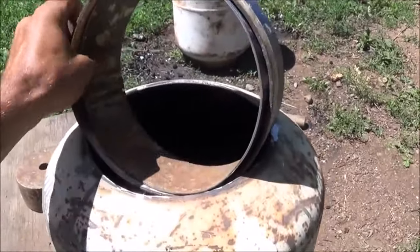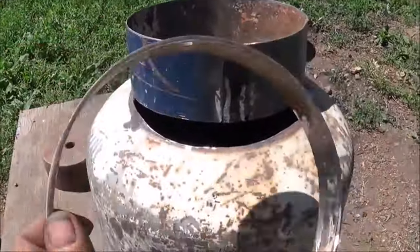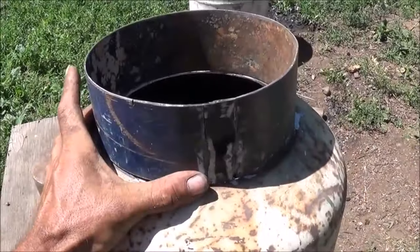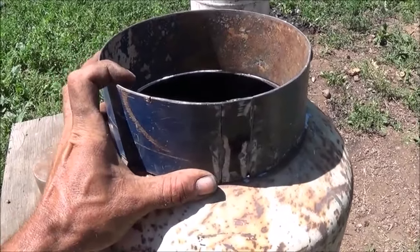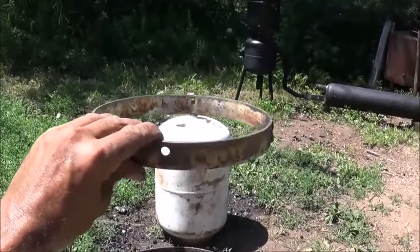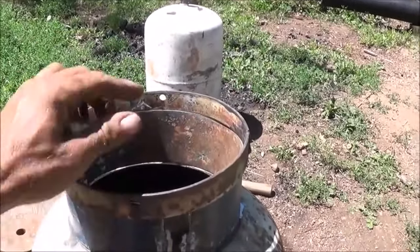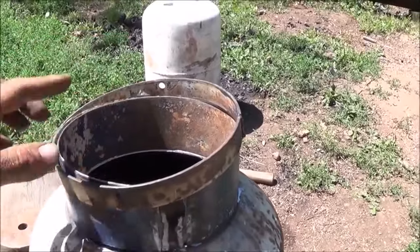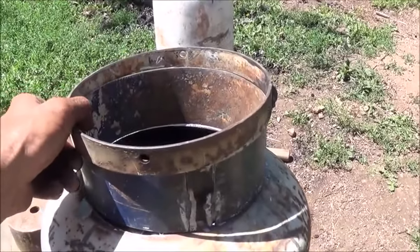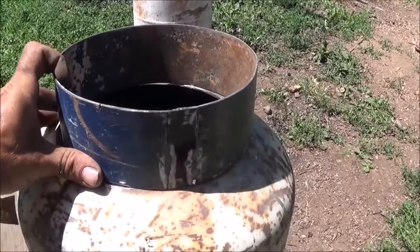On this side, I used a piece of flat stock steel and rolled it in a circle until I got the right diameter to fit inside the old ring that sat at the bottom of your propane tank. We're going to weld this to there so that ring — our reduction zone — welds right onto the upper container. This ring I measured will slide inside of it and weld onto the top of that tank, giving us a seal. We'll use the ring from the bottom of that tank to go around both of these, giving us a nice gravity-based seal as the upper mass sits down on the lower ash catch. I'll show you the oven stove door rope we put inside of that.